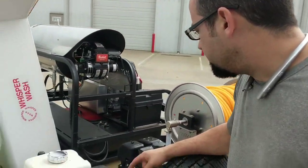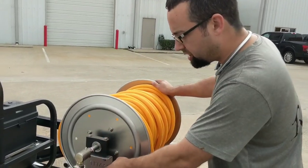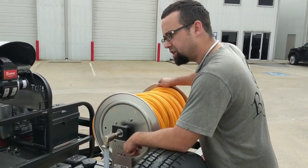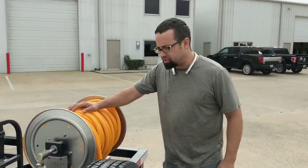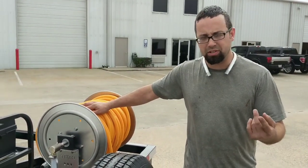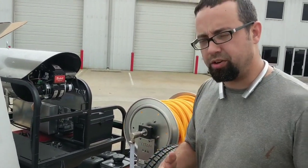This right here is going to be a Titan 18-inch stainless steel reel — this is going to be called the U-channel version. On WashMart.com it's going to be called the 4818S. And then this is going to be 200 feet of half-inch ag hose rated for 500 PSI. I recommend ag hose over garden hose or fuel hose — fuel hose degrades from the bleach over time, which is the reason why you have to use this agricultural hose, which was originally intended for pest control and lawn spraying.